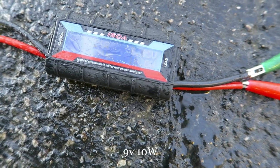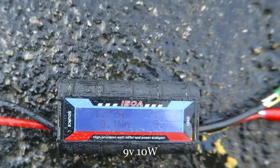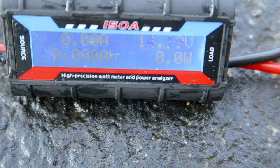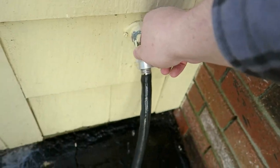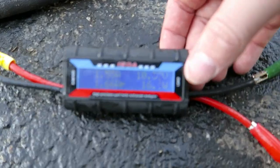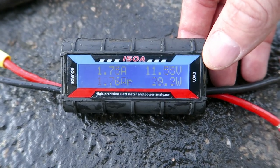It's very hard to film this power analyzer, but it's getting 9 volts at 10 watts, and this is pretty consistent. The power is actually turned down quite a bit for this little test. In the future, I will turn it up and see what kind of power numbers we can get. We'll get it towards that 14-volt range. Now I want to connect the load just to see how much it's going to slow down. I'm going through and just slowly turning up the pressure of the water to see how the output changes. Right now it's at about 10.5 volts and about 17 watts. What we get up to is right around 12 volts and almost 20 watts of power output.